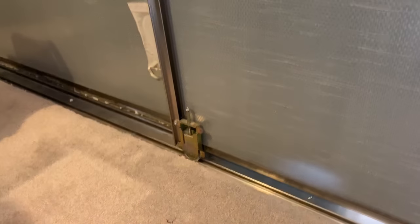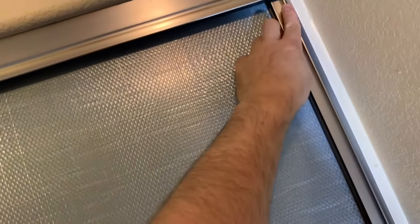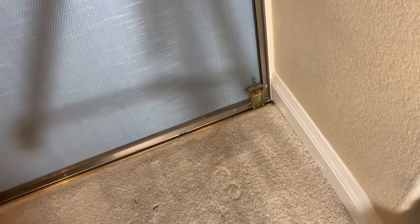That's about as good as I'm going to get. There are tiny little bumpers in between here — there's one right there — so the door doesn't slam into the wall when you close it. I can no longer stick my finger through there, so that looks pretty good. Alright, that's how you adjust a couple of different types of sliding closet doors. If you have any questions or comments, leave them below, and don't forget to hit the subscribe button. See you next time.